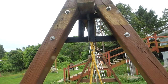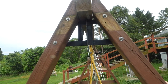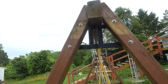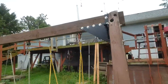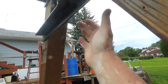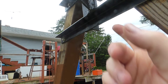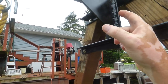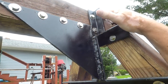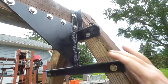I'm using stainless steel hardware. I got it at Remetco instead of the big box store, so it's only 82 cents a piece for the bolts. I've got one structural member on the back side that ties the two horizontals together, and then I have the gusset. To tie it to the vertical, or the horizontal — it's a 4x6 on top — these two bolts.